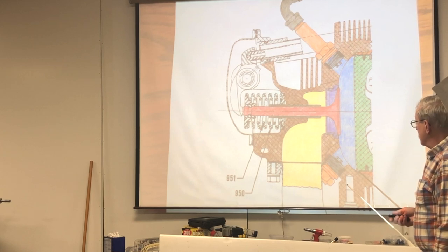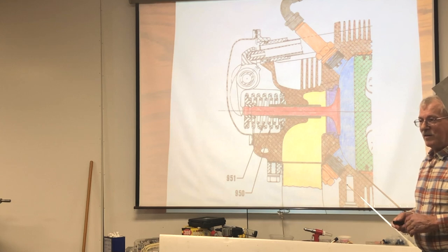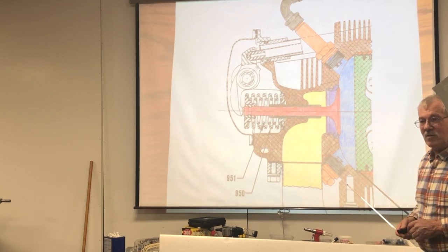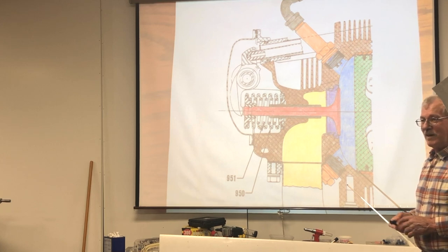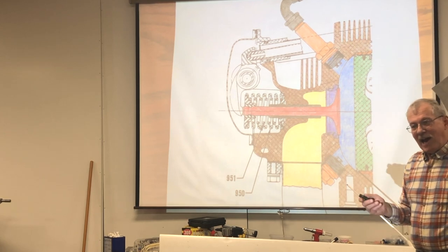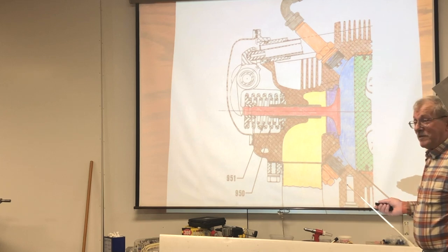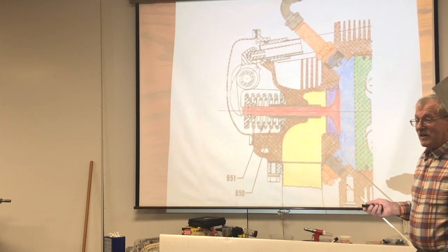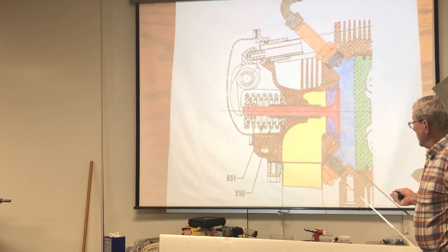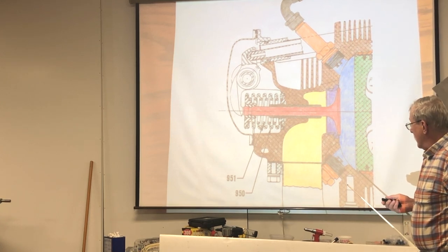I've told a lot of people about this, and this is the kind of thing that gets spread around that most pilots don't hear about, and they have a hard time understanding about holding the throttle at 1400 RPM for 5 seconds before they continue up with the power. Most people that I've explained this to come back to me a little bit later and say, I can't get out of the habit of going from 1,000 RPM up to takeoff power. Well, one of the reasons they went to the 1,000 RPM idle is because 1,000 RPM will create a little bit more turbulence in the combustion chamber, but it doesn't completely eliminate the issue because the lead is heavy and it settles down into the lower spark plug. So the 1,000 RPM thing was kind of a trade-off.